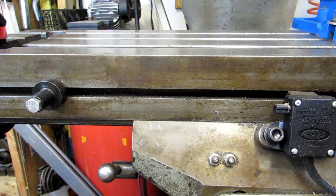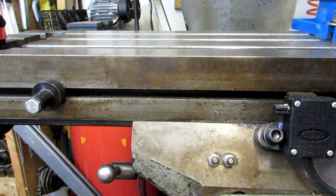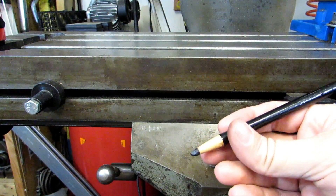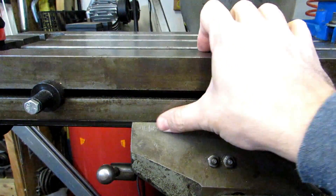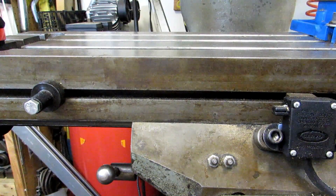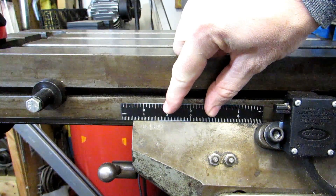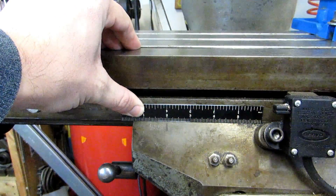One really indispensable trick when machining on a mill without a digital readout is to put a little mark in between the saddle and the table — you could also do this on the Y-axis or the Z. You could use a Sharpie marker, but I actually prefer using a grease pencil or china marker. While it's not as visible as a Sharpie, where it really shines is that it's very easy to wipe off — with a Sharpie you tend to need acetone or some solvent. On the home shop machinist forum I saw someone who glued a long thin scale on the front of their table so they could put a mark at a convenient denomination and see exactly how far they had traveled from their original zero.